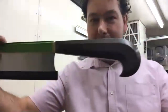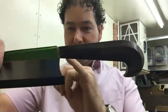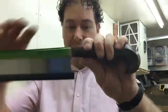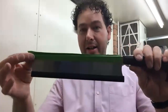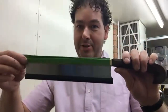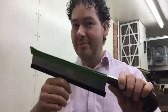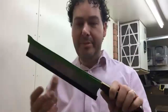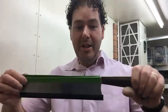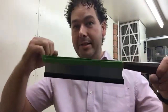This is one that's just going through at the minute. You have no interference on the blade. So the blade, effectively, the woodwork is not doing anything to interfere with the blade. And the blade's tensioned within the back. Now, the tensioning that we do is not like what anyone else does. So a lot of people say, well, how come your saws feel so tight and so stretched and you can't really move the blade about? And that's due to a process that we developed, which ensures that the blade remains constantly tight and pulled when it's assembled.